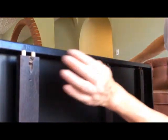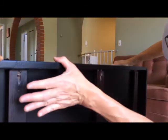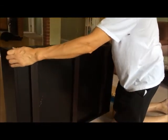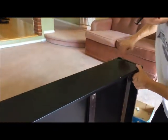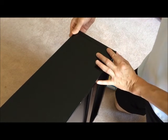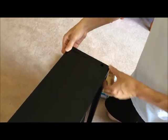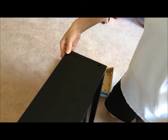This is the very, very tricky part. If you have a lovely assistant, this will be the part that will be very, very helpful. That's my lovely assistant's hand. As you can see, once those three go in and these two are holding in place, you now sort of have the drawer. Now, you would think that this back piece would be right up flush, but it doesn't have to be. Because the woods are not always going to be perfectly cut and perfectly fit so that it's flush. Sometimes this back will come up a little bit or out a little bit — it's okay. It's the back of the drawer. As long as the screws come together to hold it together, it will work.